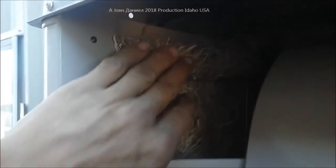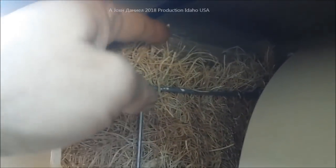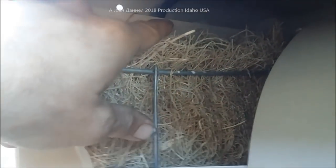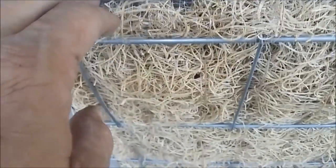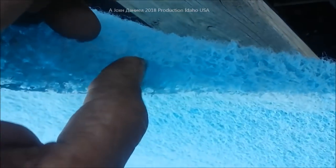Remove this panel and you're going to notice up in here how this fiber material just completely gets where it's losing alignment to the water flow. This one has a tube feeding it here, another tube here that feeds that front panel, and a tube that feeds this panel. The way these work when you're using this fiber material - look at the large gap here. That really sucks when you're trying to get the water to go down through here, so you're not getting full flow.